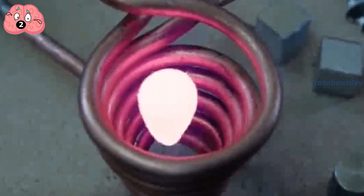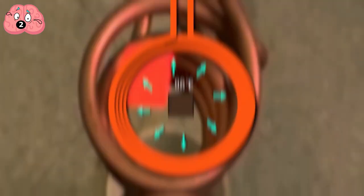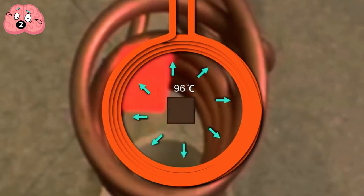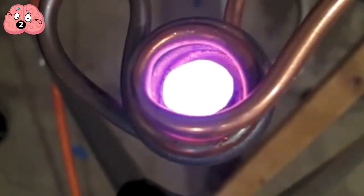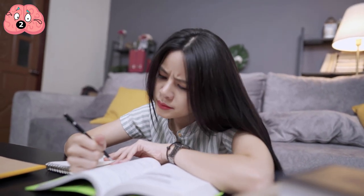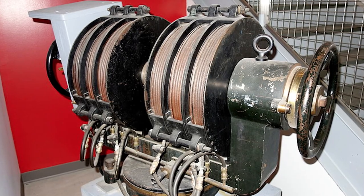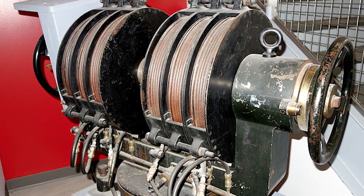That is a basic application of the Biot-Savart law in electrodynamics. The alternating magnetic fields caused by the current in the metal coil gradually deposit heat onto the suspended metal. The current then fluctuates back and forth around the coil, accumulating even more heat, which results in the shiny puddles that you now see. The reaction is actually kind of slow from a party trick perspective, but it can be accelerated with a stronger electromagnet — though it will also be much more dangerous to handle.